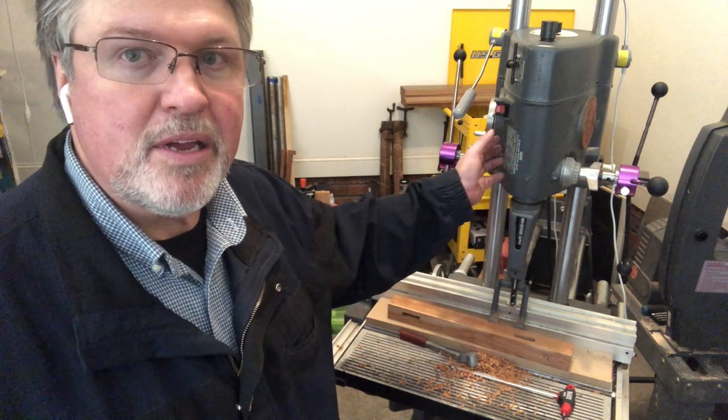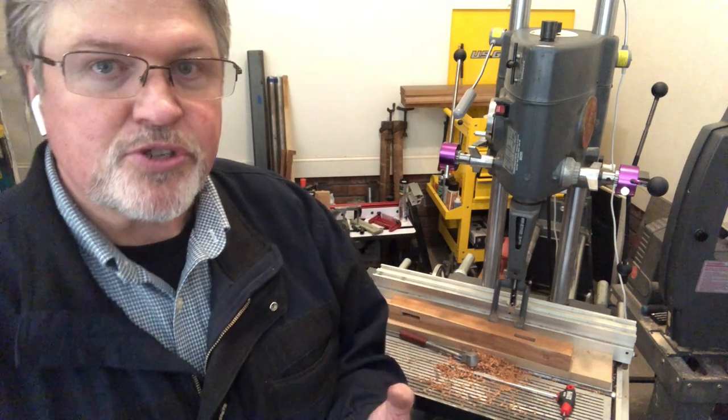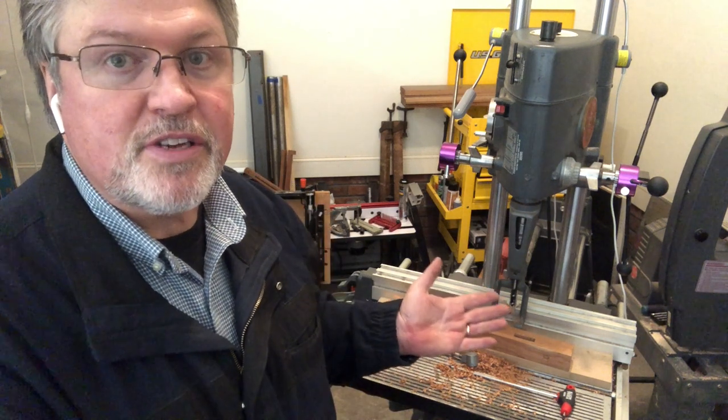Get yourself a diamond cone stone for sharpening the inside, and a flat diamond hone for the outside to knock off the burr. I seriously recommend checking out Jeffrey Baker's website for the multi-spoke handles. One question that came up was whether you could damage the pinion — there's a rack and pinion, the rack machined into the back of the quill and the pinion on the shaft. Shopsmith has had this machine for hollow chisel mortising since the 1950s, and it was rare we ever saw damage to that pinion. If it does get damaged, it can be replaced like pretty much everything else on this machine.